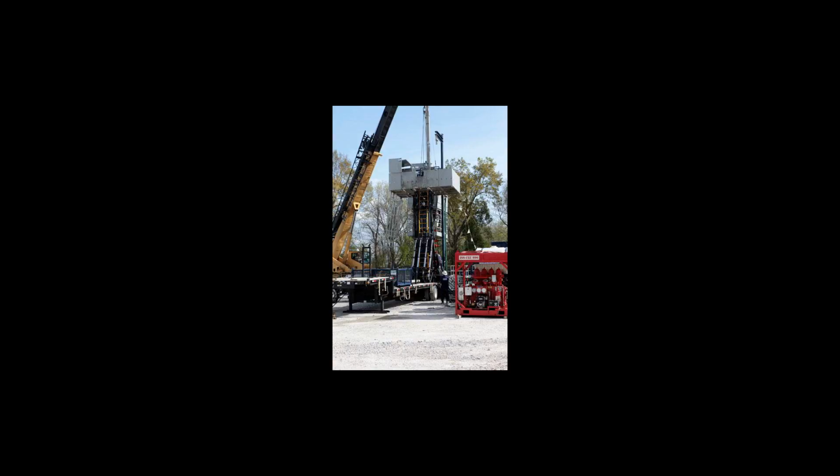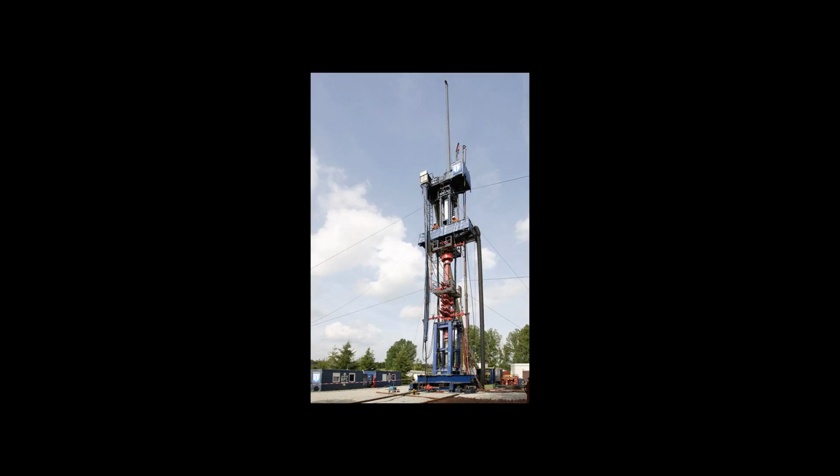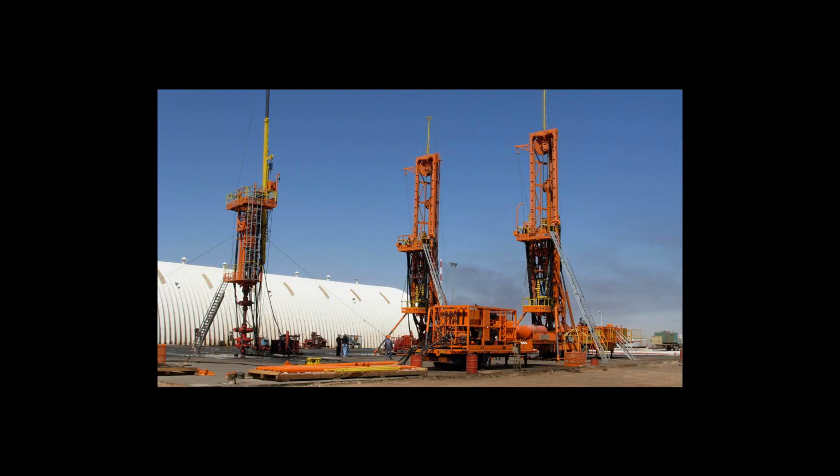Units, structures and capacities. Units vary in strength. There are 95K, 120K, 150K, 170K, 225K, 340K, 460K, 600K. The number indicates their working strength in pulling force, and 150K means the unit is capable of pulling a maximum of 150,000 pounds. This is based on the hydraulic force acting on the size of the unit's piston.